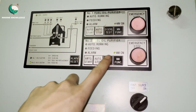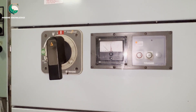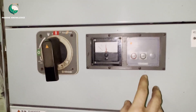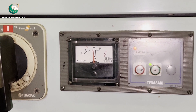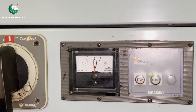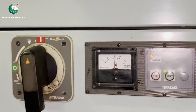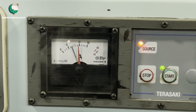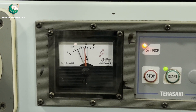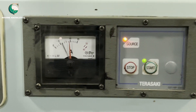With the MM function off and alarms reset, start the purifier motor. Initially when the motor runs, it will take a very high current as indicated by the ampere reading. There is a marking showing the normal running current of the purifier. Once the purifier gets stabilized, the current will come back to normal load. When normal load is achieved, it is time to proceed with starting the purifier.